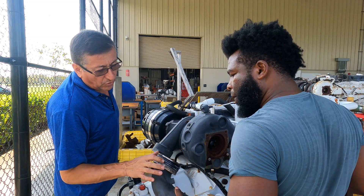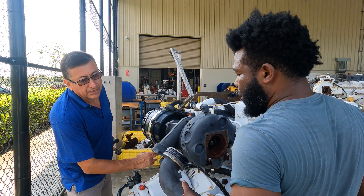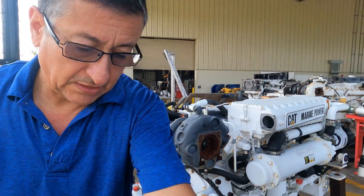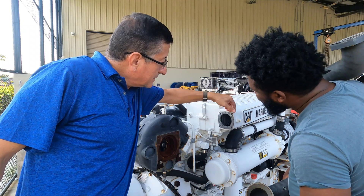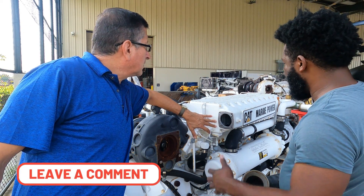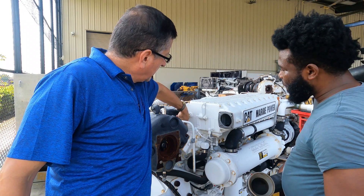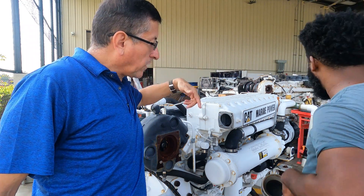You need to be careful with those O-rings and after that use a lot of grease to put them back in that area. This is a special gasket because this is usually a semi-metallic gasket — normally you replace that gasket. When you order the gasket you receive this gasket here at the bottom with the intake manifold, and both gaskets: this one, the other one, and the orange one.